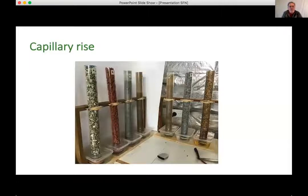The next experiment looked at how well water wicked up through the various materials. I had clear perspex tubes of 50 millimetres diameter, sat those in a container of water, and measured every few hours how far up the column of material the water had risen — you could see where the colour changed where it got wet. That gave me a measure of how high water could rise and how fast it rose. What I didn't measure but think would be interesting is the actual volume of water rising up through the column — that's something for further research.